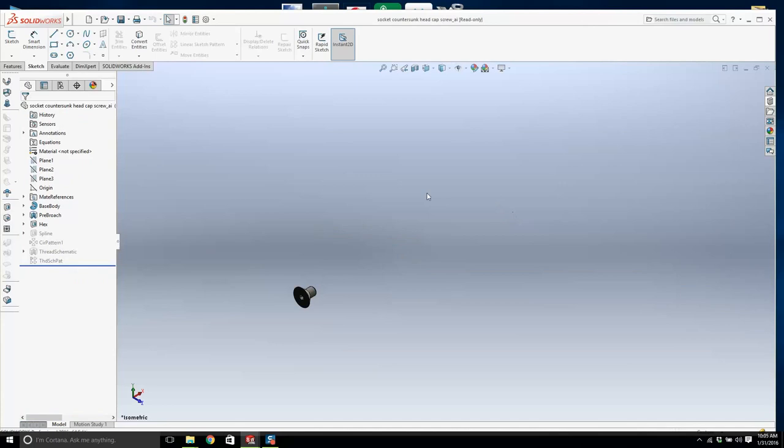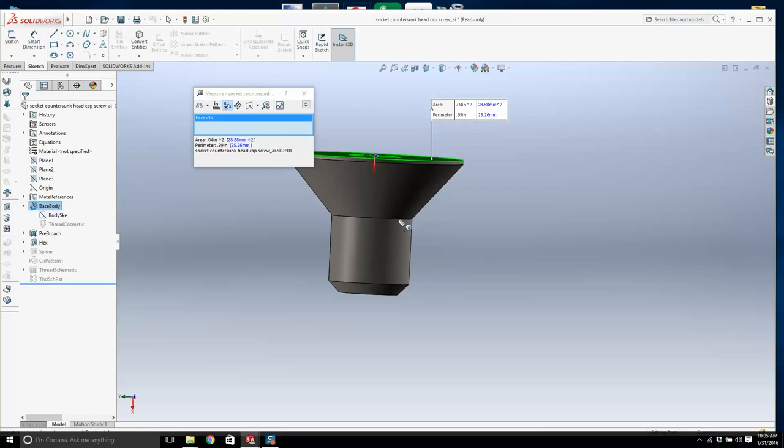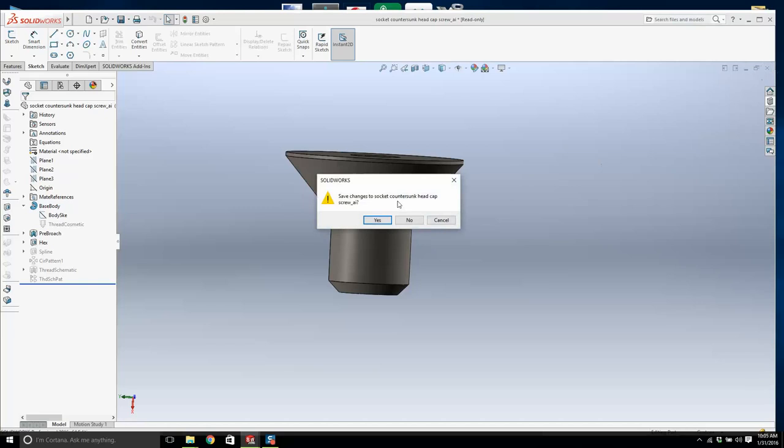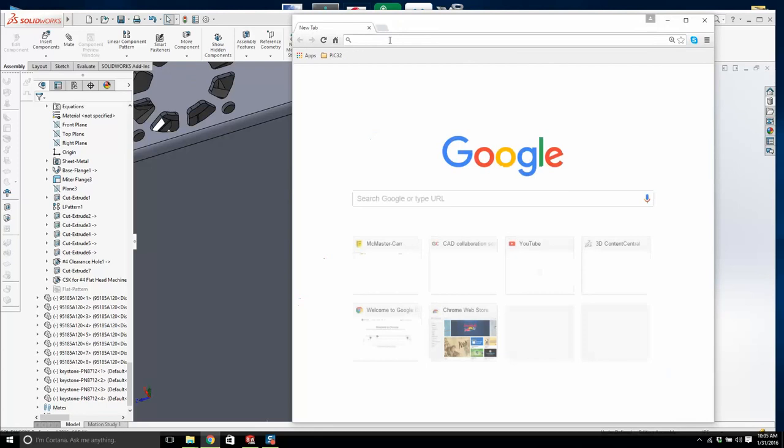Now, I don't know what angle this is, so I'm guessing it's, let's have a look. Does it tell us what angle? 82 degrees right here. So my 100 degree holes are not going to work. Now hold on a second, let's measure from there to there. That height is too big, and we're bollocksed one way or another. This is useless. We have 50 thousandths, so this is not going to work for us. We're stuck between a rock and a hard place without McMaster-Carr.